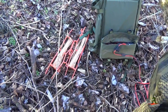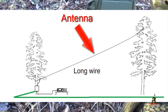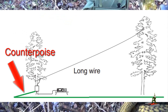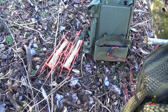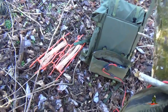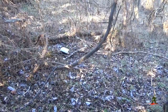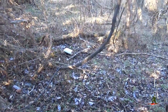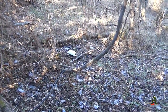Some of you might ask why I have two sections of wire. Well, one's the antenna — actually the shorter piece. And the longer piece, which is about a third longer, is what they call a counterpoise, or the other half of the antenna. When you don't have an earth ground to connect to, you have to balance out the other side of the system — in this case, the antenna tuner. Off the antenna post we're going to use the long wire, and on the ground post we're going to run some wire that's one third longer than the antenna wire, so the tuner has no problems distinguishing which half it's supposed to be tuning.